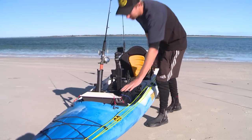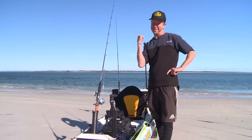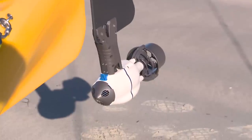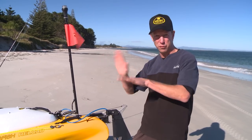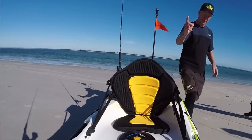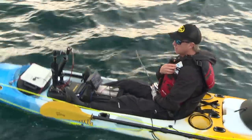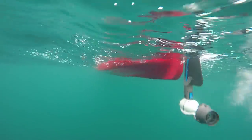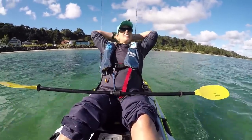And we come back here and we've got the power unit or the battery for this little thing on the back — the Bixby. Now the Bixby, this little football-sized thing that just fits on the bottom of the rudder, has hardly any drag in the water. You can still use your foot pedals for rudder just like you normally would paddling along, except when you come up here and push the button you've got 10 power settings. This all operates on Bluetooth — you can have it on your wrist, on your PFD, or fixed to the kayak — and it gives you some serious boost. This will push the kayak along at nine kilometres an hour no problem at all.